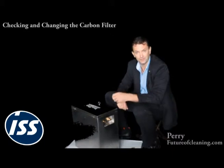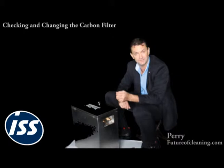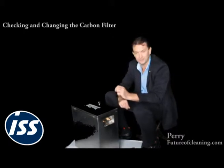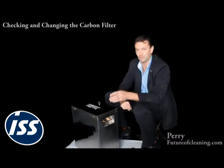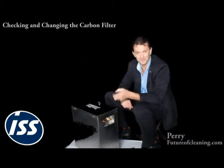Now in this video I'm going to show you how to change the carbon filter. Remember, the most important thing is you change the carbon filter either every time you change the DI resin or every second time. It's just fine to do it every second time, but you have to remember and don't let it go to every third or fourth time. So if you're not quite sure, then change the carbon filter every time you change the DI resin.